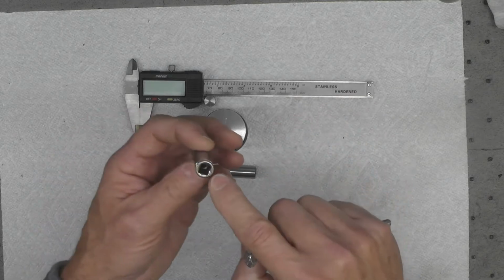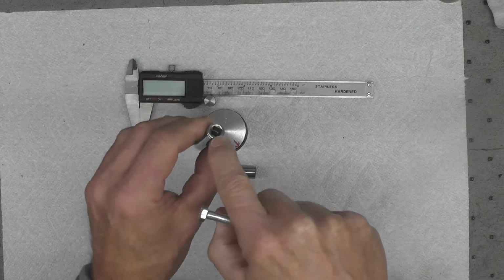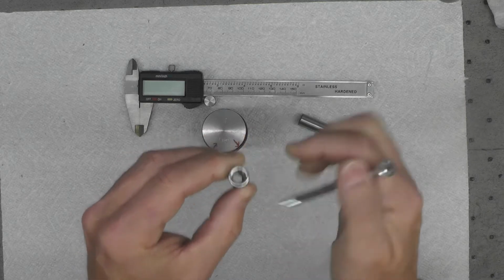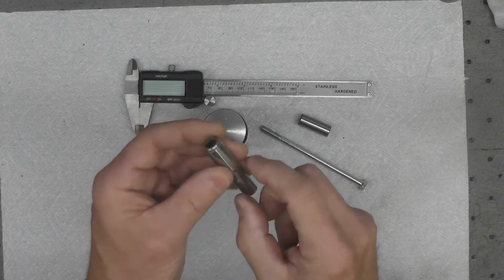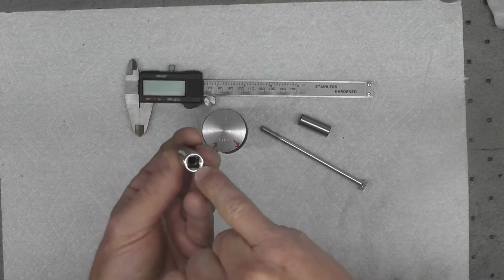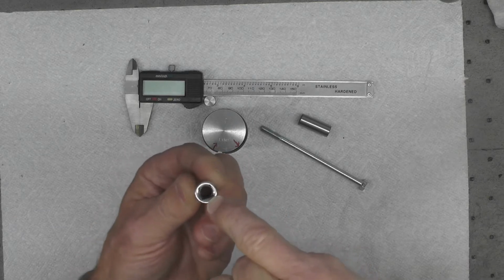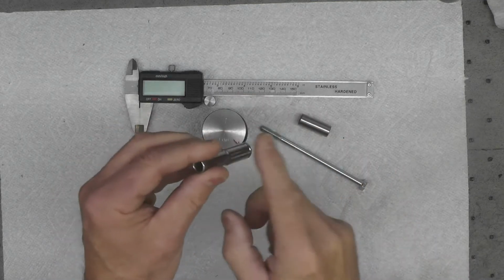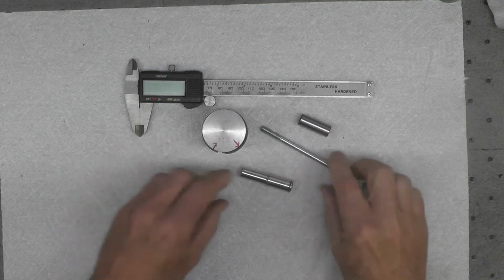which is just about the right length, I think. And what I need to do, because this won't go through the inside of that socket, is drill out the inside of that socket right there, to allow this bolt to pass through. If I do this correctly, it will not affect the ability to use this socket in the future, because where the 1/4" drive ratchet would snap into it right here is going to be unaffected by what I'm going to do next, because I'm going to bore that hole larger, deeper down inside, and I think it won't affect the use of the socket at all. Not that I use a 7mm deep very often.